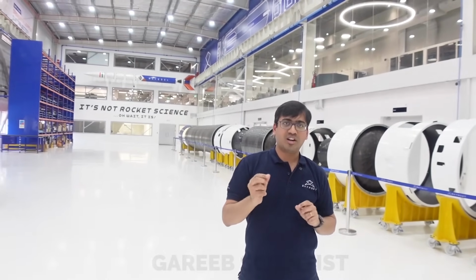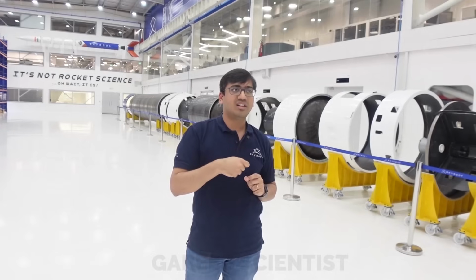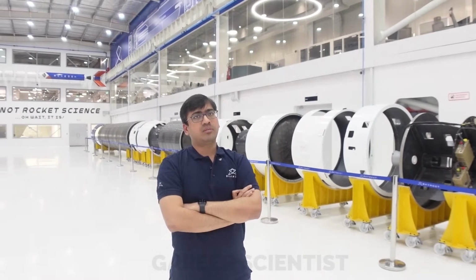Everywhere you try to optimize. Even here, we would love to have wonderful cameras beaming very high bandwidth continuously throughout the flight, but that becomes a luxury, where you have to let go some payload and some hardware becomes a little bit bigger. You need to have high bandwidth communications internally and externally as well. So will your TTC and your camera feed be two separate channels, or will they be on the same channel?